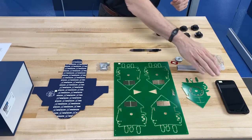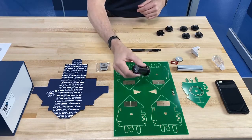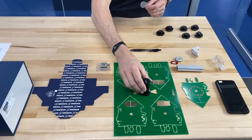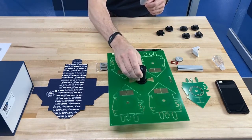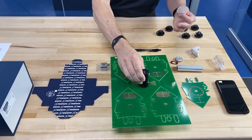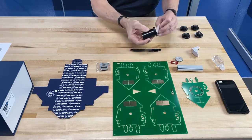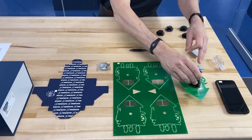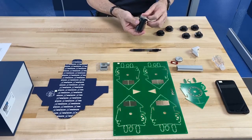We've looked at the glass. Another example would be the electronics industry where we're doing circuit boards. Simply set this in place and now we have an excellent adhesion — very good force holding this workpiece. We can handle the one larger workpiece, and again, to get it to release, we simply twist and it drops the part. Then we can pick up the smaller pieces just as effectively. So we have one tool that can pick up multiple pieces and can even pick up the scrap and carry it away.